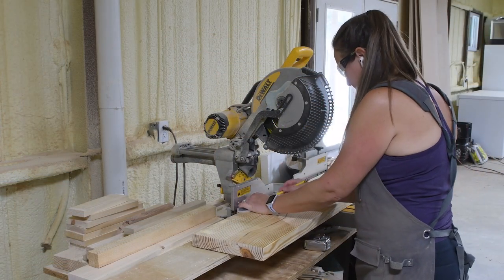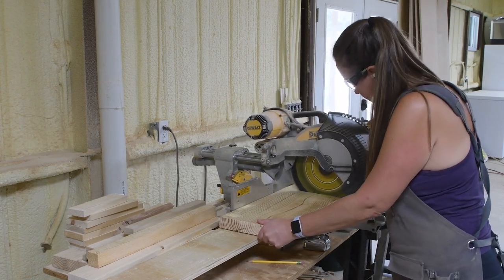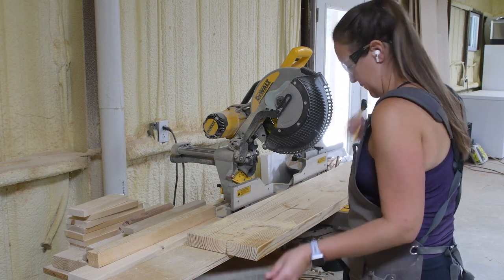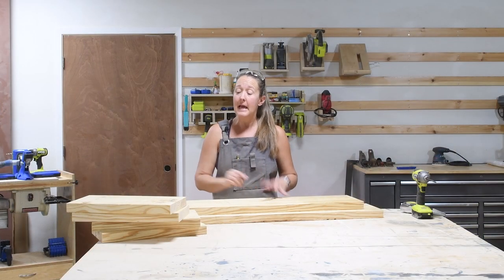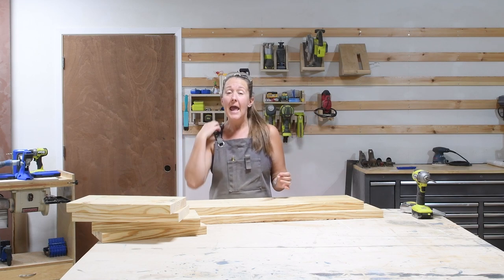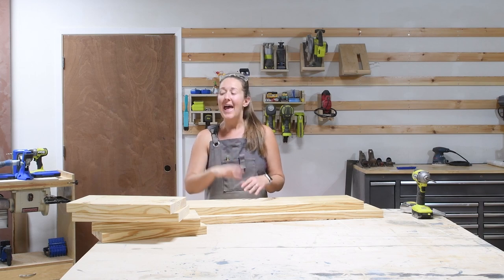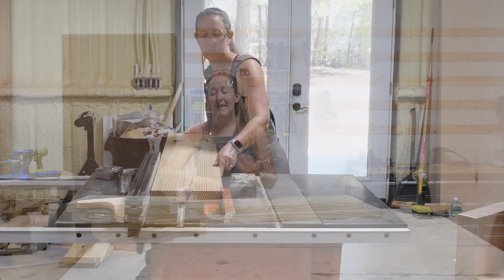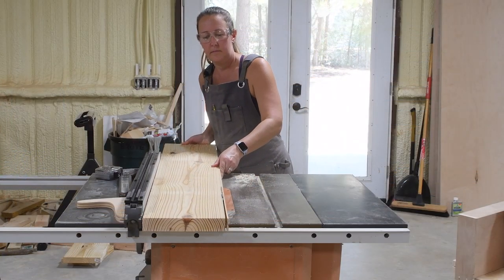The wallpaper will give me the appearance of grass cloth but will hopefully be a lot more cleanable, washable, and definitely more inexpensive. I've already cut the pieces for the legs and the top of the coffee table — two pieces of 2x10 lumber for each. All build plans can be found on kregtool.com. I cut the pieces one inch bigger than the measurements in the plans so I can use pocket holes to attach the two pieces together, then square off the ends for a perfectly square piece.